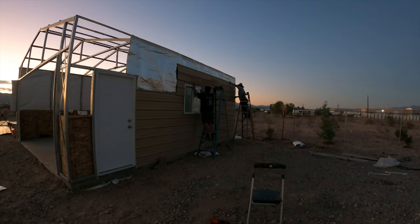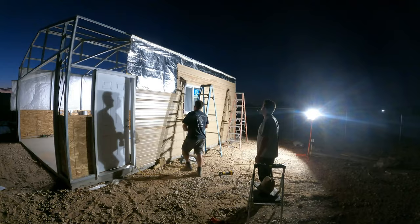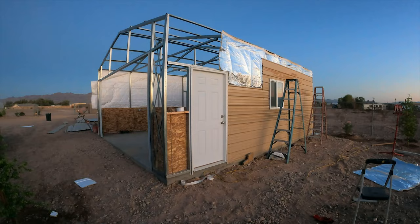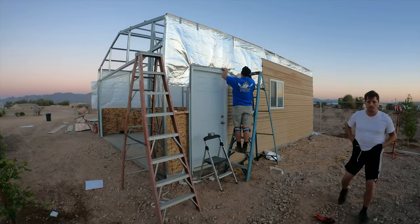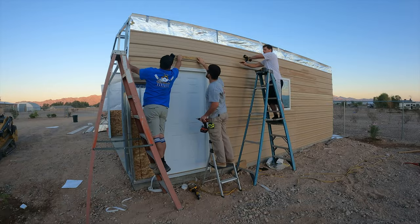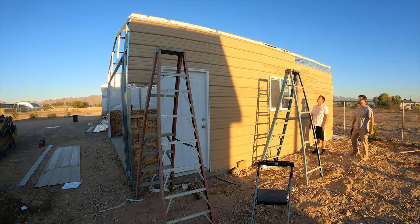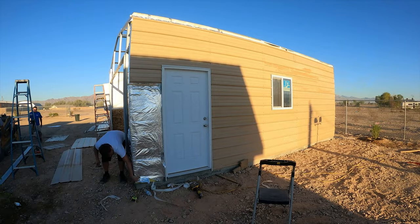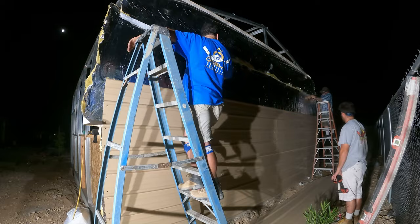Whether it was off or not, you're still on top of the window flange, so it's still not going to leak. It was pretty hot when we did this — 100 plus degrees — so we did early morning work and some night work, because handling steel when it's 100 plus is not easy. After getting all the paneling up, I used tan caulking where the door and the panels met, and also around the windows — I put a bead of caulking around everything on all the seams of doors and windows.